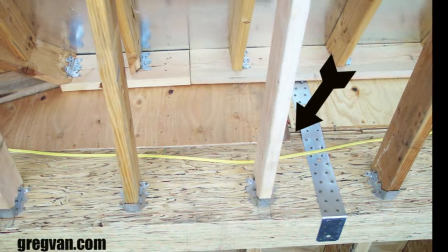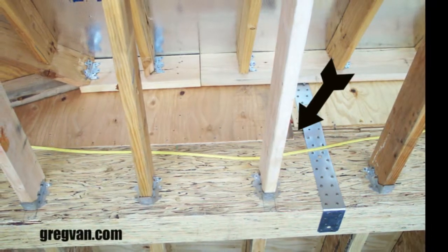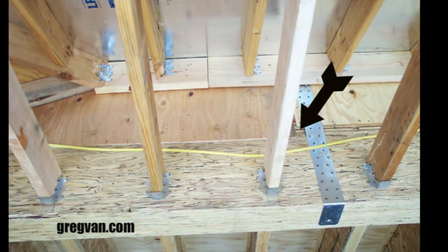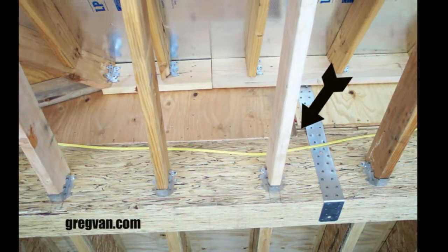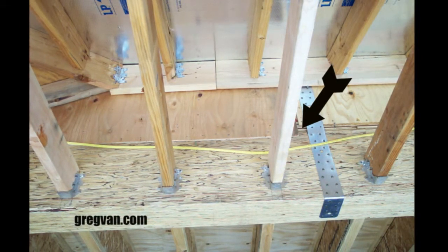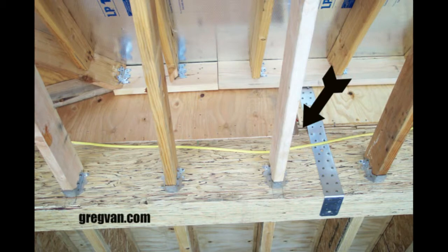And again, A35s, I can't see the benefit in some of these metal building parts or components, building hardware, than you can with something like this. This makes sense for horizontal and lateral movement. Something like this, to me, and again, I'm no engineer, is just going to provide a little more common sense structural support than an A35 that's nailed at two different angles, kind of a thing. Let's face it, you can pull on a board and pull an A35 apart. Something like this would be a little more difficult.